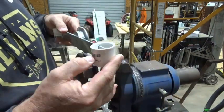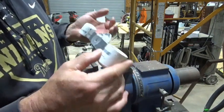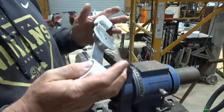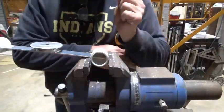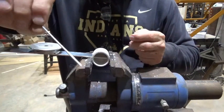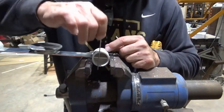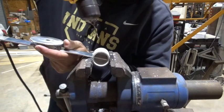I'll hold this in and drill a hole through to pin it, then trim off the extra. I'm going to use an aluminum TIG welding rod for the pinning material — if you use steel it'll just rust out, so it's better to use aluminum. Once it's all said and done it'll all be aluminum. I'm going to push the splasher prop in to where it's good and square, then drill all the way through the cap, through the plate, and out the other side, and put this rod in — it'll hold it and stabilize it while I put epoxy on.